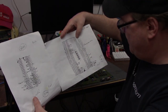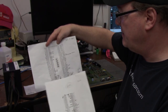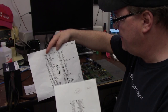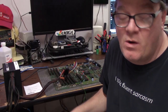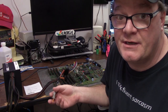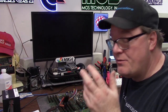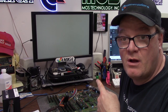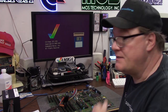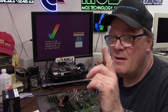Okay, so it's been about a week. When I was pinning this massive 30 wires out — 14 off the ROM and 16 off the 68000 — I missed one. Whoops. Turning it on. So here we go, we're turning it on again. With the ROM in the right place, this will now post. 2.0 ROMs, no floppy, so it takes a second. Another Amiga has been saved. Freaking awesome. But we're not done.